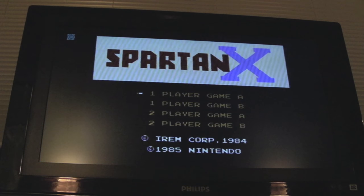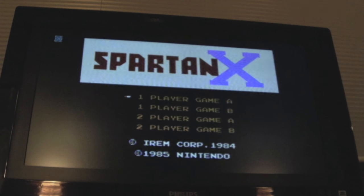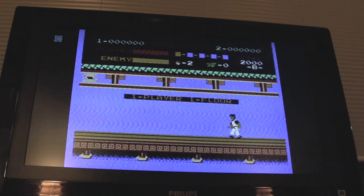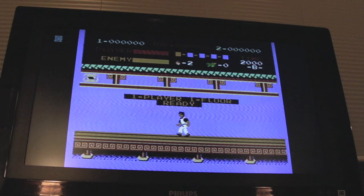Apologies, it's really dark in here. I'll show you more in daylight once I've cleaned up. But this is the faulty board — the one that was giving a white or grey screen. I've swapped the SRAMs over, and as you will see, that has fixed the problem. So it was a RAM problem. This is the one with the two controllers — the other one had one cut off — and this is the one with a good power switch. I'm pleased with that because it means the CPU and PPU are fine on this one. Yeah, there we go — it's working fine. Obviously I can't test the sound until I get the sound wired up, but that's really good.